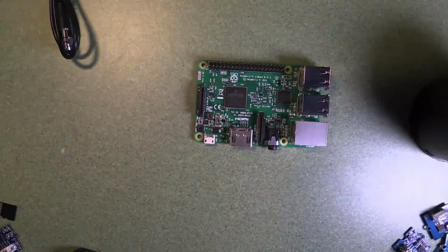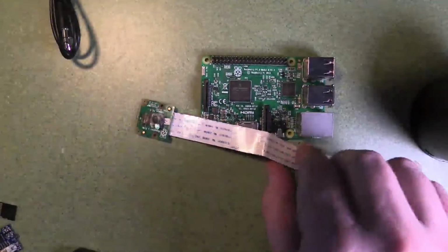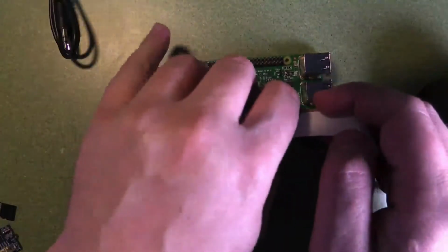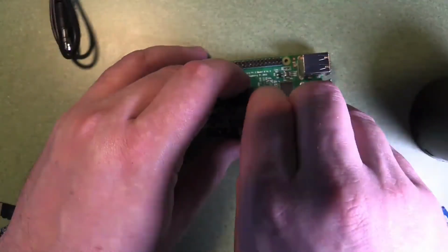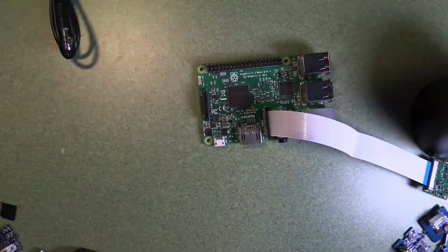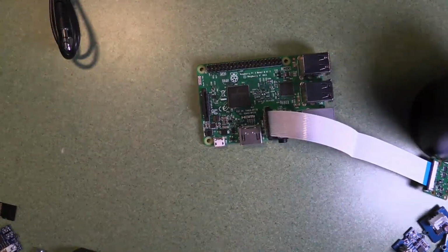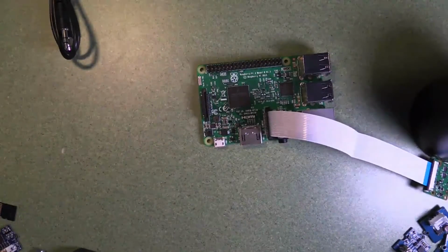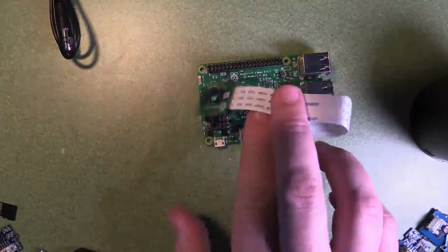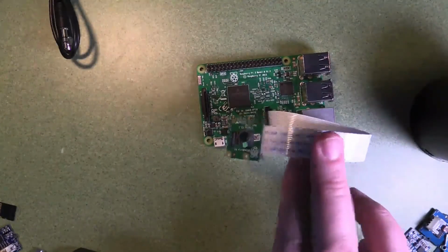So a good example of that is the camera board here. This is a Raspberry Pi camera, and it has this ribbon cable with a number of contacts on the end here, as you can see. To connect that, you plug it into the Raspberry Pi here and close that down. It's a standard connector called a CSI connector for cameras for the Raspberry Pi, and it provides enough connections that the amount of data that's going to be necessary to pass down that connection can indeed be connected. So cameras are a bit different, and they have their own special connector.